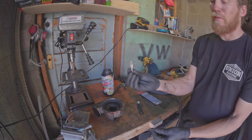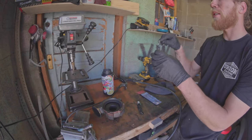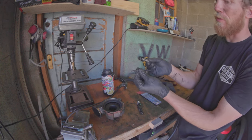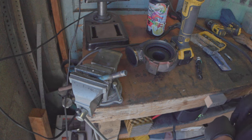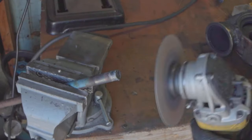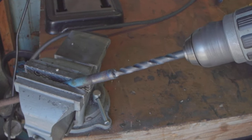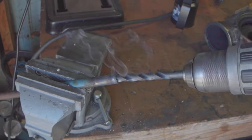Pipe threads are slanted — to cut slanted threads you use a drill bit that hits the minimum diameter of your tap, and the tap itself is tapered. There's a slight angle on both sides, and that taper is what allows pipe threads to seal: as you turn it in it gets tighter against the fit you created. I find I have to run this tap in pretty far to allow most pipe threads to form. This surface isn't flat so I'm going to run the angle grinder over it first to get a flat start.